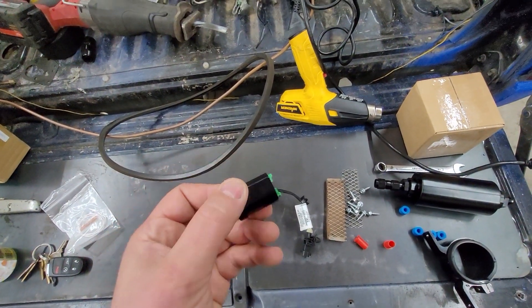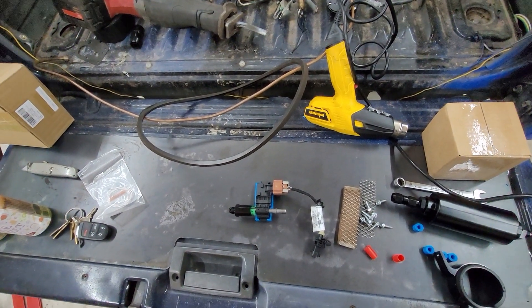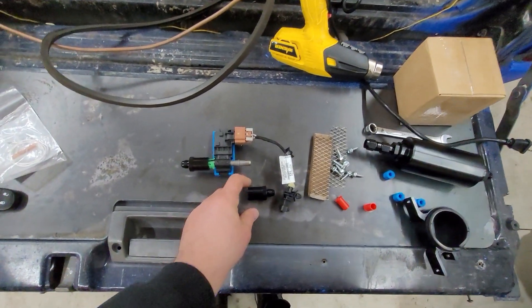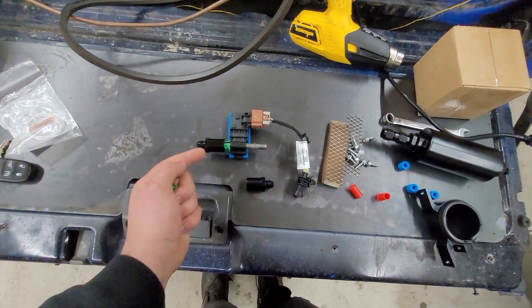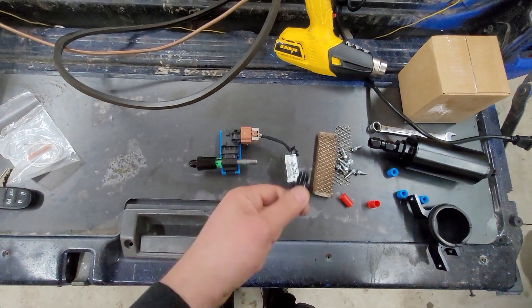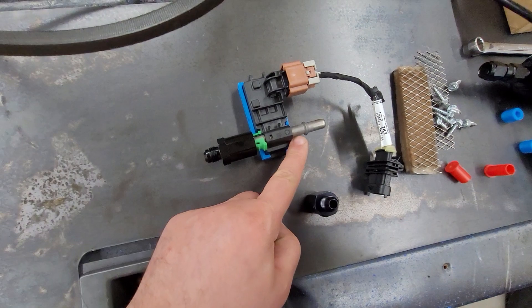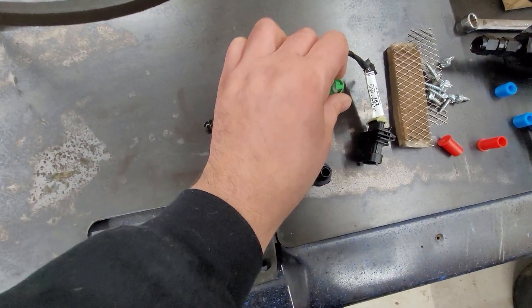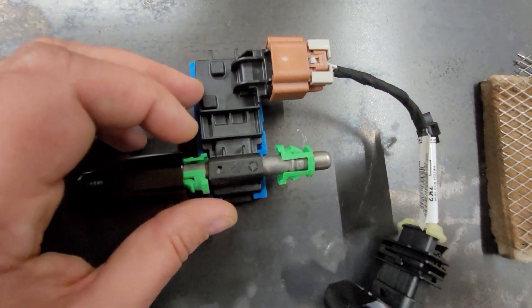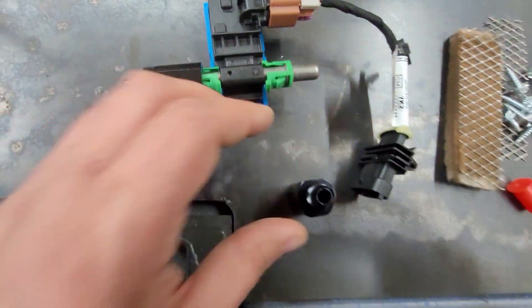It came with these push connect fittings, which is why I want to show you guys real quick. I'm not really a fan of these because they're pretty easy for people to screw up. What you should know — it's not a matter of just ramming the thing on there. This insert actually comes out. You don't need a special tool — I just did it in one hand while you were watching. And then you see this lock? You push this on until — see the little tabs? They've got to clip around that. Now that is totally locked in.